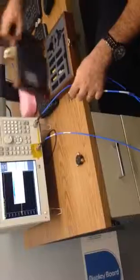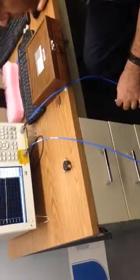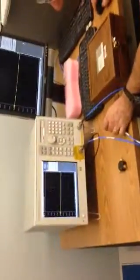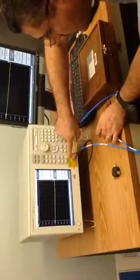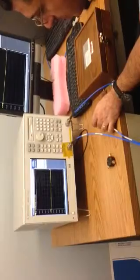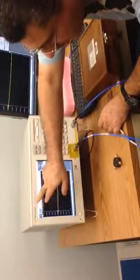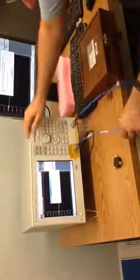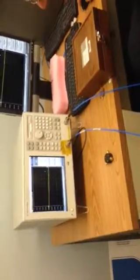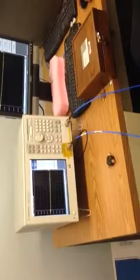Before making the calibration, set the frequency and the number of calibration points. Set the points to 200 — you can use any number of points, but 200 is normal. Set the start frequency and make the frequency range cover the whole range up to 8.5 GHz, so the device works with the full range.